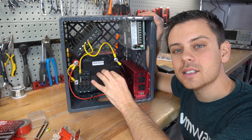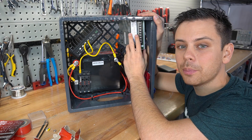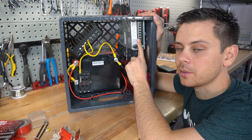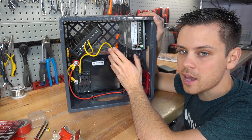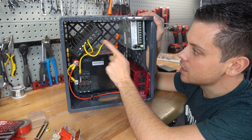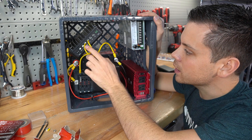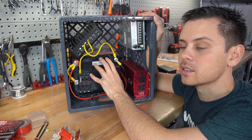The next step is adding AC charging to this system. The problem is this outputs only 10 amps, so charging the battery directly with this regulated switching power supply would take five hours. But we can increase this rate by connecting the output at a higher voltage to the input of the MPPT. If we satisfy the needs of the PV input, we can charge at 20 amps or a max of 260 watts at nominal voltage. So we're going to take the DC output, boost the voltage to 24 to 32 volts, and connect it to the PV input.